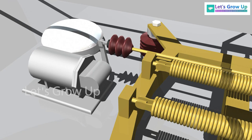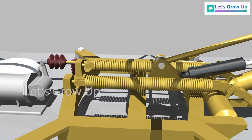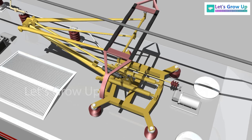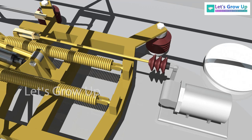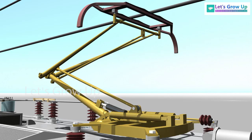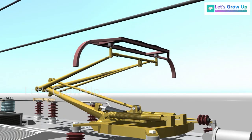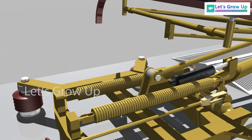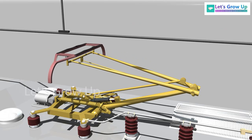From this point, the servo motor plays no further role in the control of the pantograph. The pantograph balance is then maintained through the main spring. A hydraulic piston provides better stability. At the time of lowering, the pressure drops in the cylinder, causing the piston to return to its position and the control rod pushes the lower arm spindle down. This admission and release are done through the throttle valve, which allows the pantograph to lower slowly.